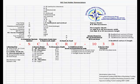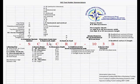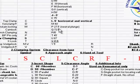It will just go ahead and peel the material off as it goes. The other one is the L that you see here, which has 5 degree clearance on the horizontal and the vertical. Again, this is a more common insert, or more common holder. This is what we use, the SCLCRs. And again, the rest of the letters are listed for some of the other ones.